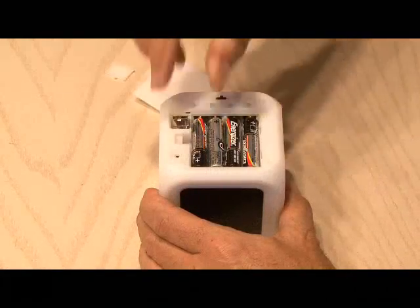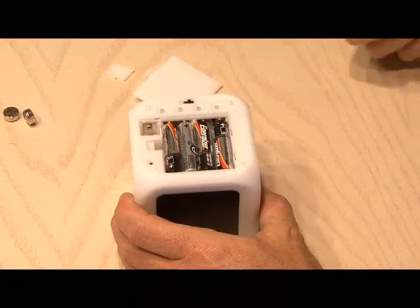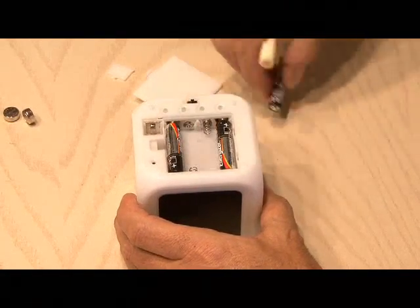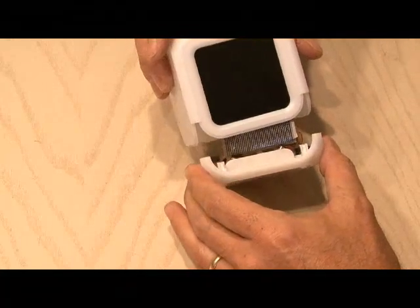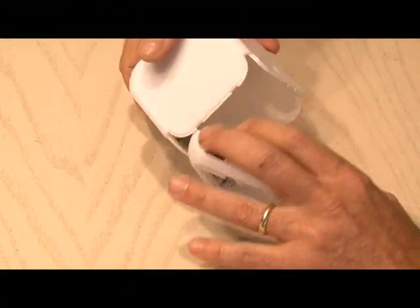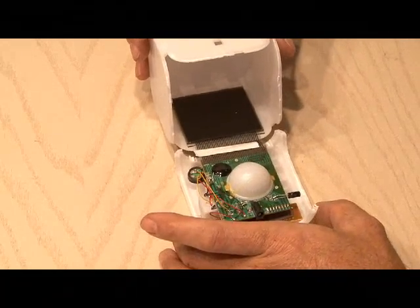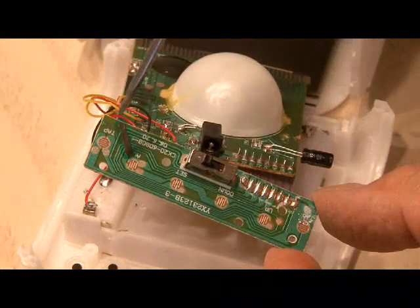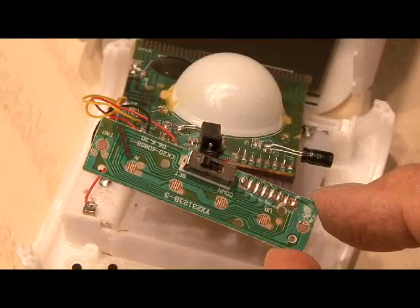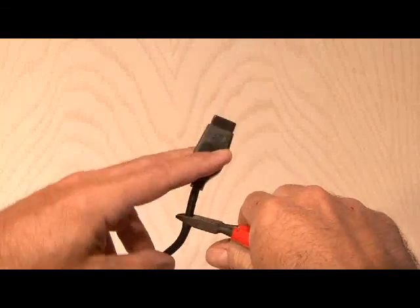Then we're going to disassemble our alarm clock. Remove all the batteries — in this case there were two little button cells and four AAs that powered the LED. This alarm clock actually unsnapped and came apart, revealing a little circuit board inside. Our main focus is the tap buttons that basically shut the alarm off. After you trace back from the board the tap buttons and identify the connections, that's where we're going to make the connection for our light phaser.